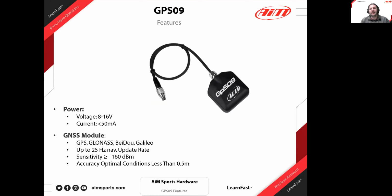Yeah. Typically, all the systems were made with aluminum. Aluminum has a big advantage. If you choose to work with it, you have the possibility to move the heat inside the system out of the system itself. So you can keep the microcontroller cooled by the system itself. Plastic could be a choice, but for what we think, it's not so professional. So in some little devices where it's not so important to have the professional system, the bigger resistance of the system, or for example, where the weight is very, very important, we move to the plastic case. But typically, we want to stay with aluminum for these reasons.